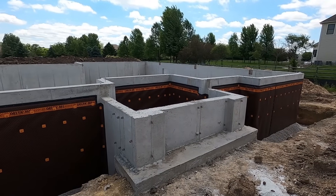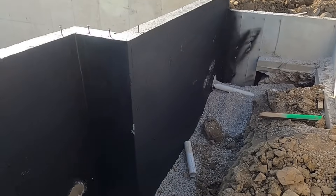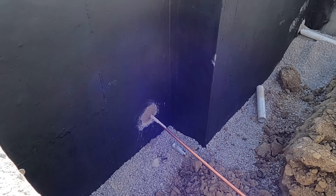The reason we choose Delta is that concrete cracks — there are hairline cracks, it just happens as part of the drying process. Even though you can get a crack in a foundation wall, it's not a structural issue, it's just what concrete does. I love this system because anytime there's a crack it bridges it, so you won't get moisture intrusion. With a spray-on system, a crack will often create a split in that coating, giving you a potential moisture issue.